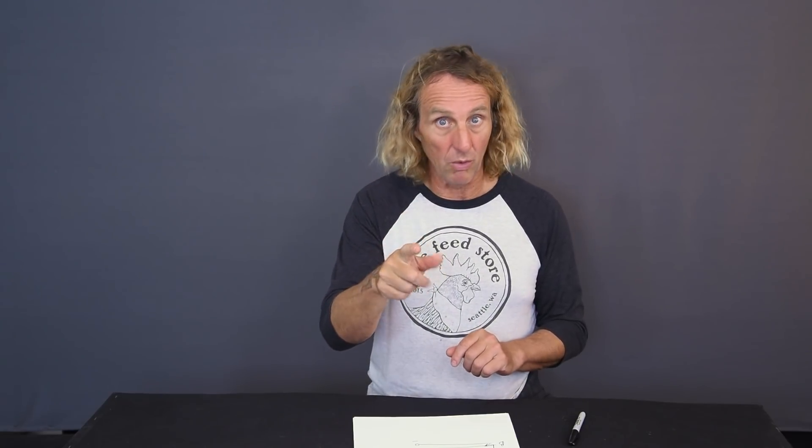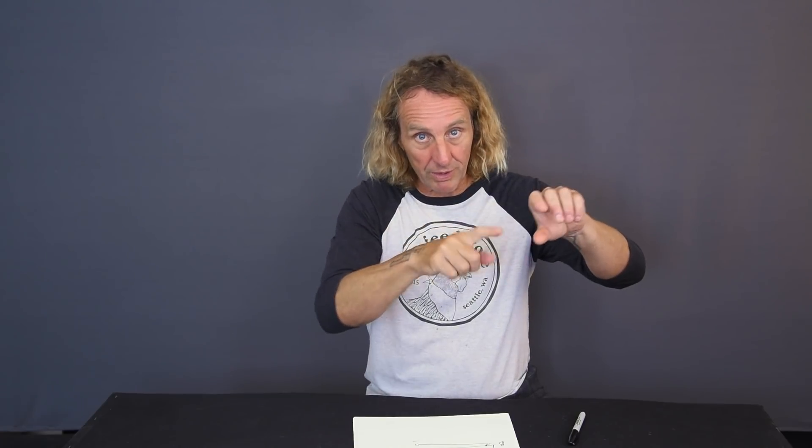So how do we do it? Very complex. You take an XLR balanced input — it's going to be easier with an XLR balanced in — and you run it into a Y cable. You take one side of the Y cable going to amp number one. You put a polarity reverse on the output of the other side of the Y cable and run amp number two. Now amp number one is in polarity; amp number two is out of polarity.